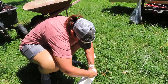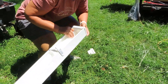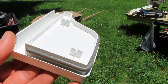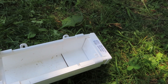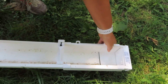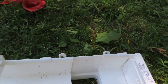Laura's putting the end cap on now. Those just slide in — no compound needed to secure them. You've got the material that catches in to them. We went ahead and spaced everything out 12 inches. You can see the downspout — we had to put a piece of gutter in so we could connect the end cap securely, because the end cap will not connect to the downspout. We pushed it too far in, but on the downspout there are measurements for how far to come in. So we started our screws and we're ready to install.